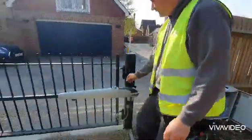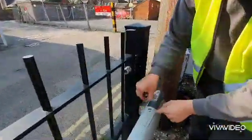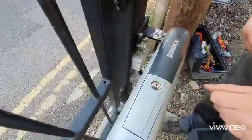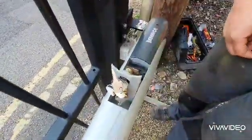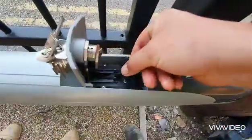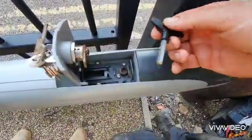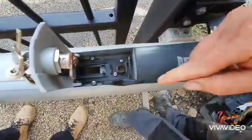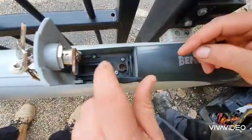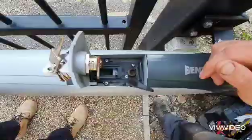With your override keys, you want to put your key in — you slide this back, put your key into the top clockwise, and then that opens this. Inside here you'll find an allen key. If your allen key is missing, make sure you get the right sized allen key to fit into this little slot. So putting your allen key in, you follow the guidelines of the arrow and you're looking to twist it anti-clockwise. You'll hear it click like so.